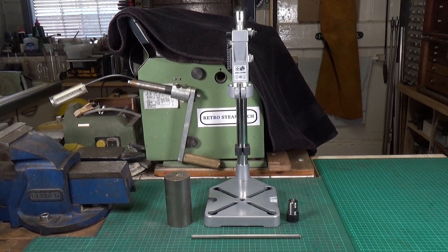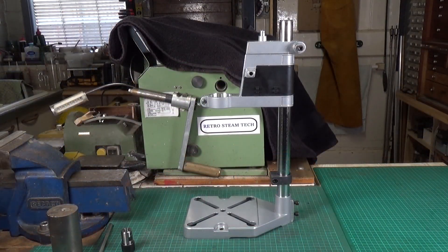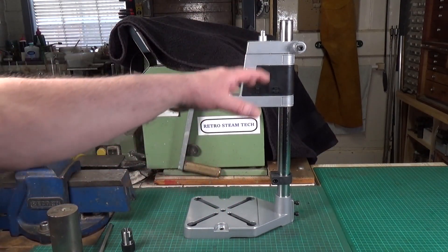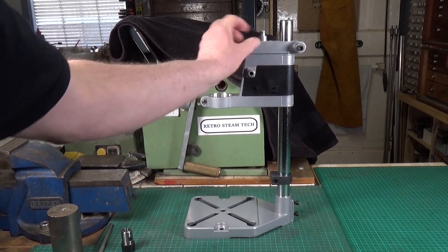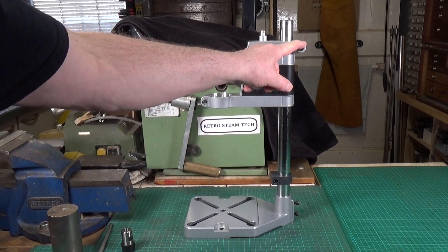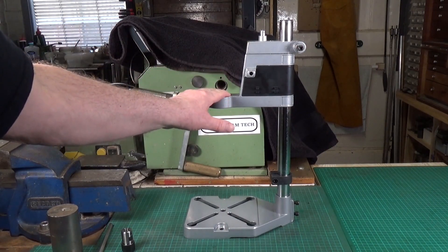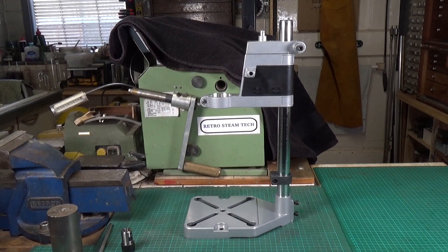So I had a look around and had a think. What I came up with was this cheap and nasty Chinese drill press stand, which I got from eBay. I'll give you a closer look. I've taken a load of parts off this — it would have had a handle — and I've locked the two parts together so this is a solid lump now. You can adjust the height by doing this cap head Allen screw; it'll slide up and down. But this is the bit I was interested in — this is the bit that will hold the tapping guide. It's a pretty nasty drill stand, it doesn't weigh anything, but I can make the base heavier should I need to.